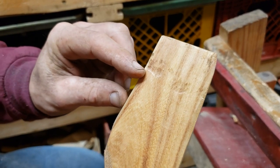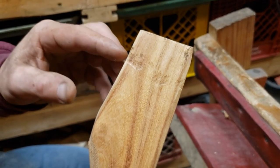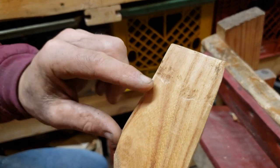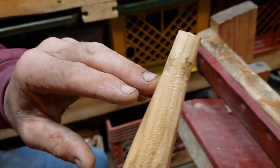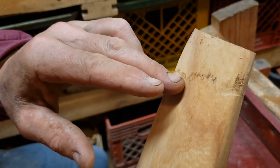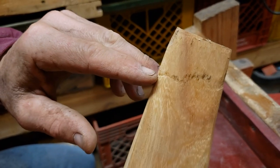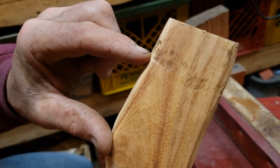Here are the friction marks from the first real test fit where I used a couple of mallet blows to drive it on there. Little bit of a compression line here, a little bit here, but no curls forming. And that's because I deburred the bottom of the eye, but I am getting fairly uniform friction marks all around for the very first test fit.